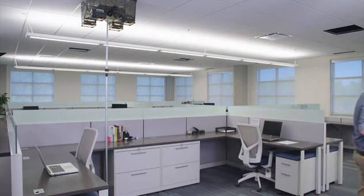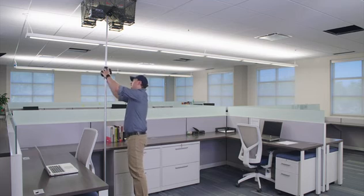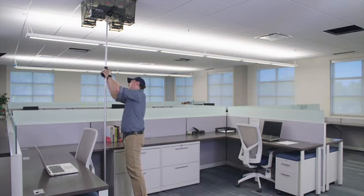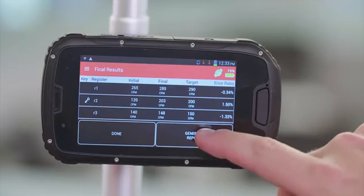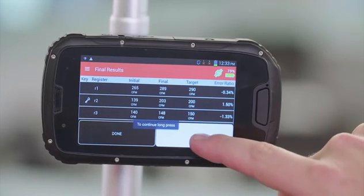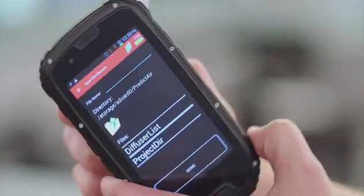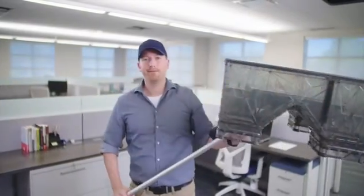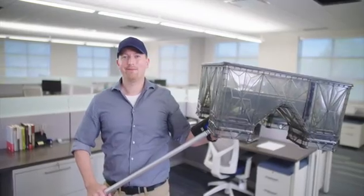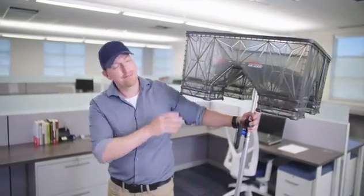200 yards of range allows us to make our adjustments while reading the register in real time. Now we have met all of our design requirements for this branch. Our on-screen report indicates that we are within 2% of design flow. The report can be exported via email or saved to a file and imported into a tab reporting tool at a later time. The Smart Air Hood Balancing Instrument with PredictAir application software will cut your balancing time in half while providing accurate and rapid results.